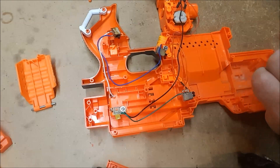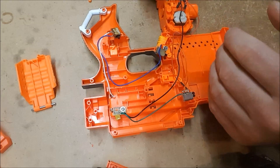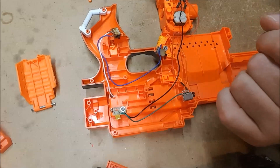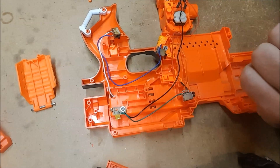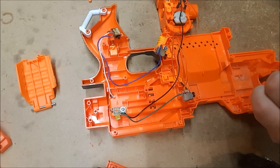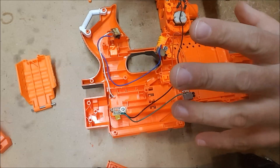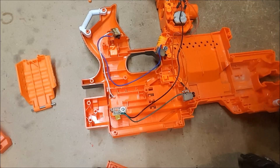So that is my recommendation for how to diagnose a flywheel blaster: start at the motors and work your way back through all of the switches. If you eventually find the failure point, then replace that component and your blaster should work. If you have any questions, comments, concerns, suggestions, ideas, or better ways of doing this, go ahead and put that in the comments below. I hope this was helpful, and thank you for watching.